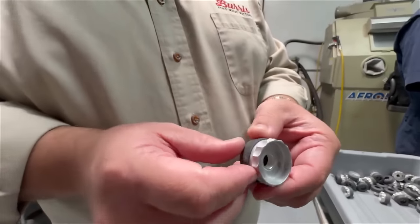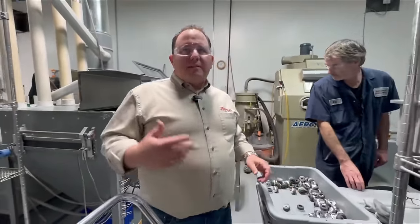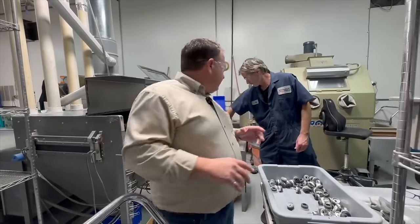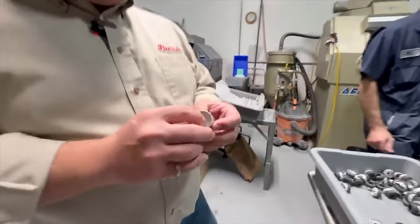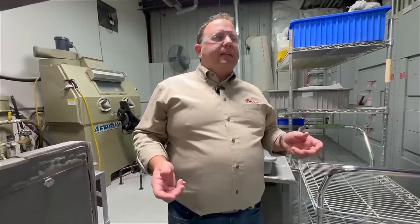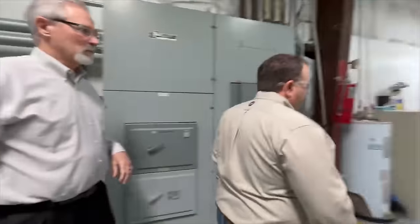And then we've got to go through and make the finish consistent, a nice matte satin black that you typically see across all the products in the rifle scope. So what we do is we take the part and it gets bead blasted. Because again, aluminum is soft. You can scratch aluminum very easily. So we go through and we do a type 3 anodize to the components. I usually like to equate it to an M&M, right?